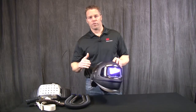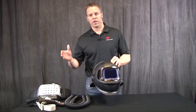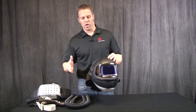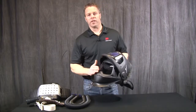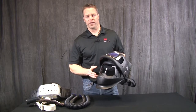The side windows allow you to see what you're doing as you go along the weld, see the end of it, and see if there are any hazards such as trip hazards or anything that might get in the way. This clear visor meets a face shield requirement of 300 feet per second per the ANSI requirement.